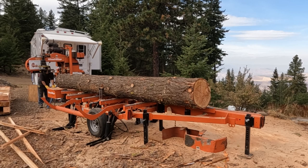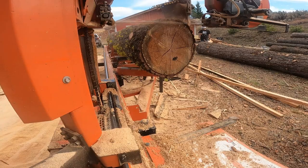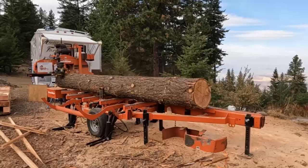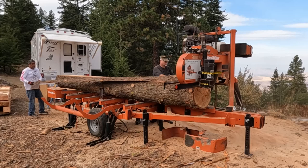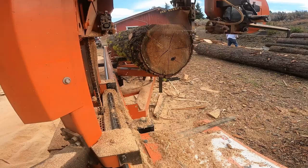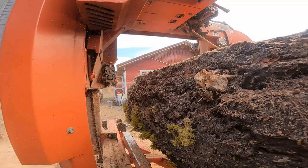And it's not really making it level, folks. I mean, some might think of it that way, but my mill's not really level. These Woodmizer single rail mills, they call them cantilever mills, they don't need to be level. You could have them kind of going uphill or downhill or on a bit of an angle left or right. Doesn't matter. As long as that long side rail is solid to the ground, and yes, you see it bounce around, but that's just because it's not bolted to the ground, right? Big logs are going to make things bounce around.